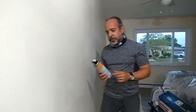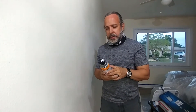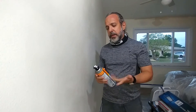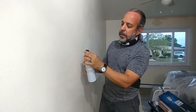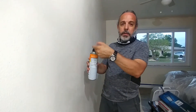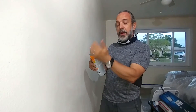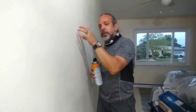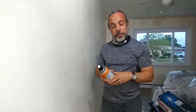One thing I want to bring to your attention: there is a little plastic gizmo that comes on the front of the nozzle when you first get it. Any guy out there — I didn't read the directions, I just took it out and tried to use it and the thing wasn't working. Then I figured out that you have to break that off. It has an adjustment with a long tab, and the adjustment goes from three o'clock to nine o'clock. Wherever the short tab is pointing, that's where it's set. At three o'clock it is the lightest texture setting; at nine o'clock it is the roughest texture, almost like little peaks. My house has very mild texture, so I'm going to be using the lightest setting.